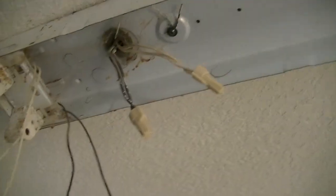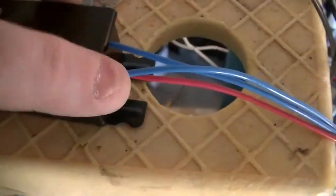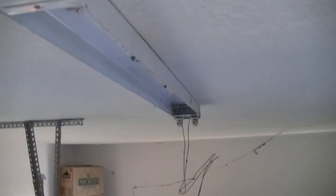So there's our black and white power coming in. Now I've already turned off the fuse box. Those are obviously hooked to this black and the white right here. Then each blue wire goes to both of these. Now it used to be all wired differently — the power used to go in here, this was connected to this, and then it also went over to power the ballast. That's not the way these new ones work. So you've got your blue, blue, and red. One blue wire goes to both of these — you can cut these or keep the length. These get twisted together and go to one blue, these get twisted together and go to the other blue, and then the red one connects to both of those wires. That blue and red get twisted together and go to this red one. It's as simple as that.